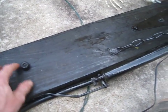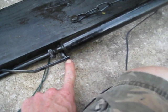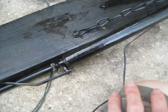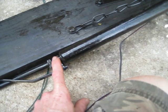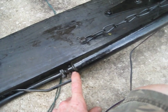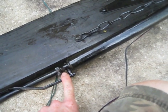Over here there's just a little rubber stopper for when it comes back down to cushion it a bit. The reason this bracket is like this is because if the screw was simply screwed straight into the wood without support it would very quickly work itself loose going back and forth. Long screws meant for wood don't handle side loads very well — if you hit one sideways it will easily break off. So we have this bracket to provide support so that doesn't happen.